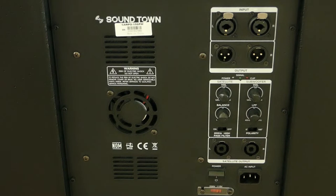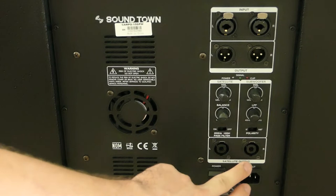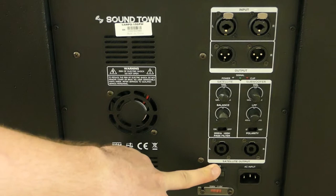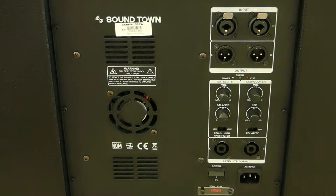Below those two knobs, there's a 200 Hz high pass filter, which I do use — this ensures the signal going to the top speakers doesn't carry a lot of low bass, which would cause them to distort more easily. So I turn the high pass filter on so they're only getting frequencies above 200 Hz. Then there's a polarity switch for the subwoofer — if you're not hearing much bass output, it could be a reflection canceling the signal, so flip the polarity to 180 degrees and that may give you better sub output. At the bottom we've got our satellite speakon outputs, our power switch, AC input for the IEC, and a fuse. Also, tipping the camera forward, you can see a pair of rolling wheel casters — I really like that they included those. It's very thoughtful.